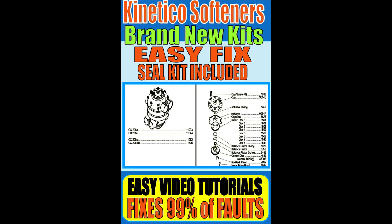We have eBay listings, but the more expensive kit is the one with the level seals. The other kit is the one with the moving seals, and so it doesn't come with the level seals. But generally speaking, the cheaper kit will work and will solve a lot of problems. You know, the balance piston seal and the actuator seal at the top causes a lot of problems, and then you've got the small quad ring seals which are on the valves inside. They cause a lot of problems, and if they let by, the softener doesn't work properly.